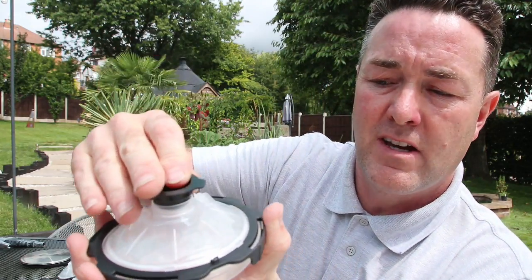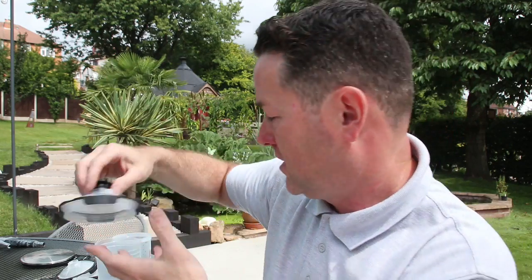So you'll have a pot ready, pot with white in it, do the frame, you could change your tip or anthracite on the other one. So can you see the benefits of this spray gun? Because I can, particularly for doing UPVC spraying. That bung goes on there, keeps your paint fresh, sealed.